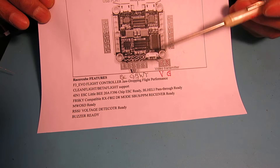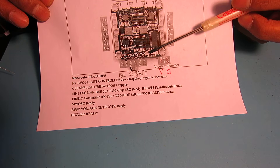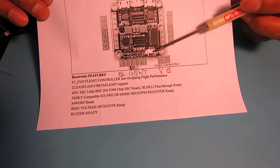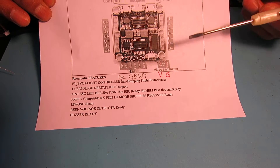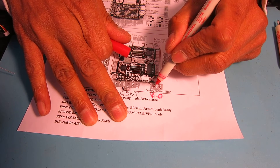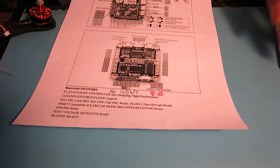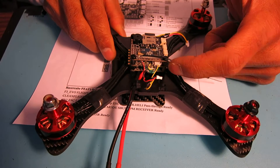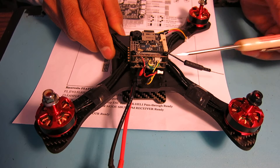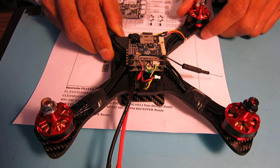The documentation shows that the ground is on the inside and the video out is on the outside. I made a mistake writing this down, but the documentation is correct — just pay attention. You may have to de-pin the plug and reverse the wires to get your video to show. If you're having a problem seeing your video from your OSD, that's your issue right there.